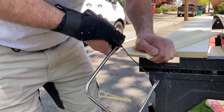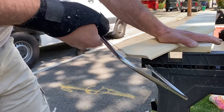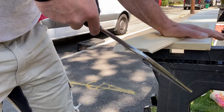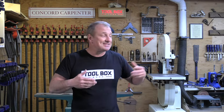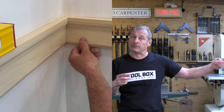Coping is a little fussy and it takes some practice — you got to get some reps in. Here's a tip: fit the cope first, then cut the length of your molding. Whether it's base, chair, or crown molding, make sure that joint fits well before cutting to length. I usually leave the molding piece a little bit long by a few inches and cut and fit the cope — because if I make a mistake or don't like my cope, I can re-cope it and still have room to play.